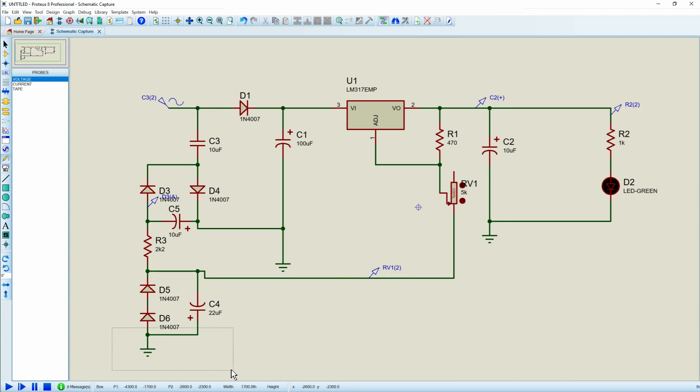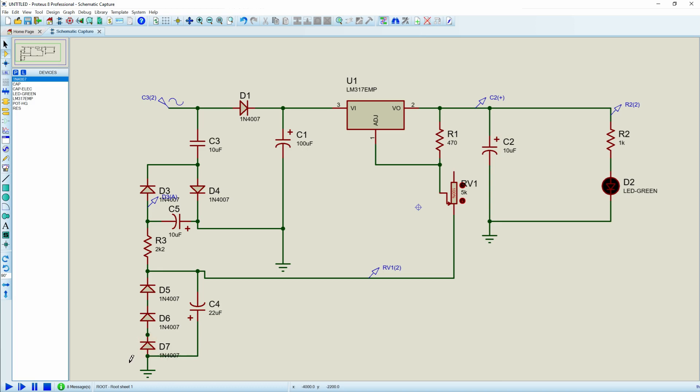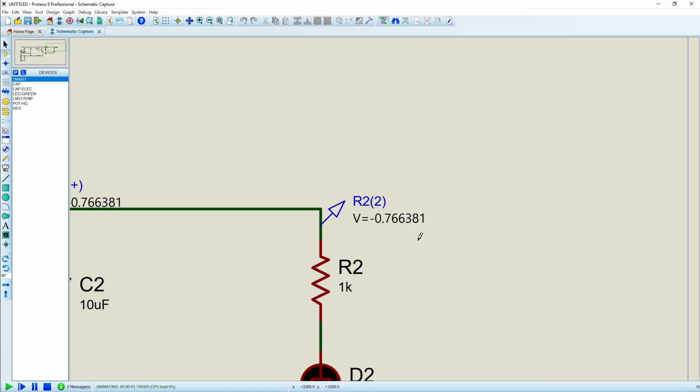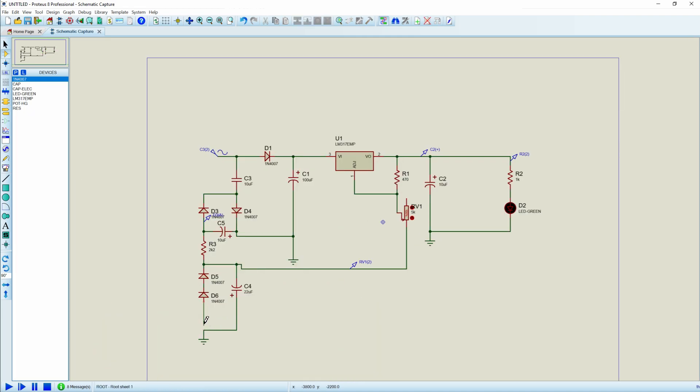If we wanted, we could add a third diode — and running it, we can see it goes down to negative 0.7V, which is too far. In practice, the 1N4148 tends to work a little better than the 1N4007 for this, and they're lower cost. One thing to remember is that we do need a fair amount of current through here, so the decoupling capacitor needs to be fairly large. If you limit it too much, you'll have trouble getting enough current through. Number two, because we're introducing a negative voltage...